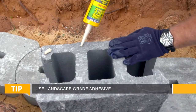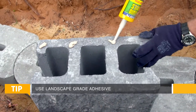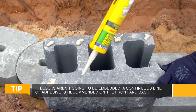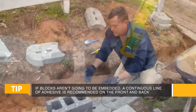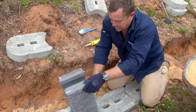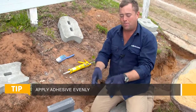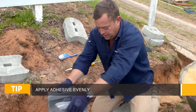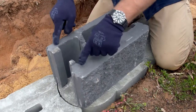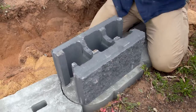The reason why is because you need an adhesive like liquid nails. What I do is nice even blobs, evenly spaced out. You can get carried away and put more on than that, but what I've used is absolutely enough. And it's important that your blobs are even from one end to the other, because big blobs at one end and little blobs at the other will change your levels on you.